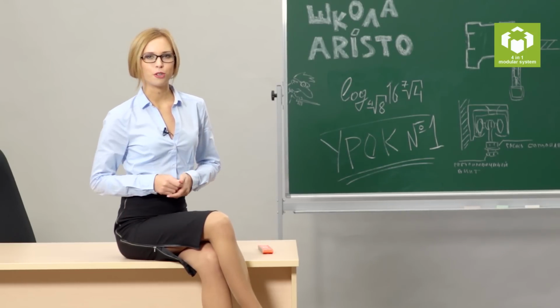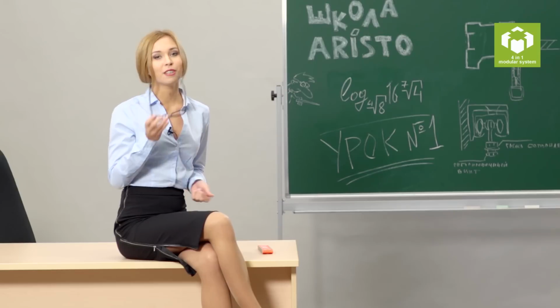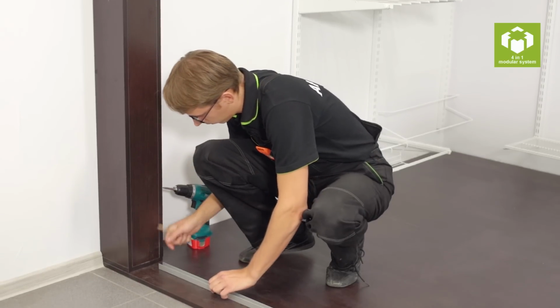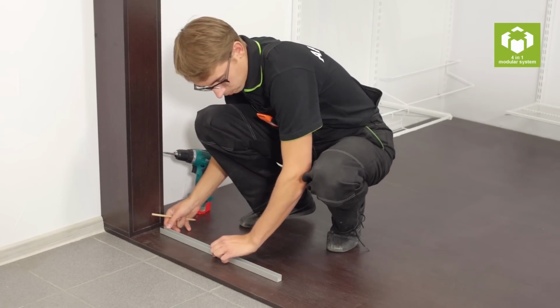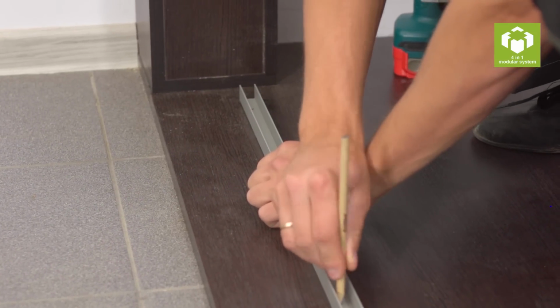After installation of metal fixings into the top angles of the room partition, bottom angles should be fixed with assembly screws. Mark the floor with a pencil where the U profile has to be installed and tie it off to the floor.